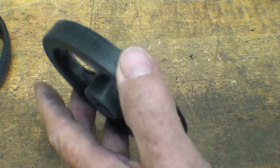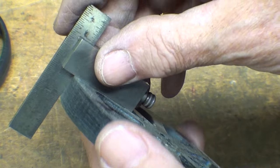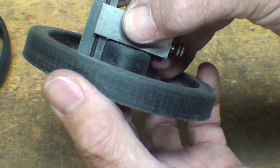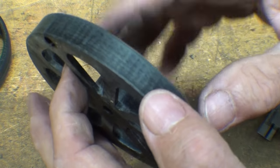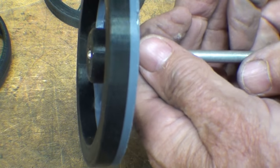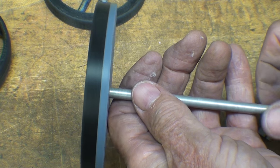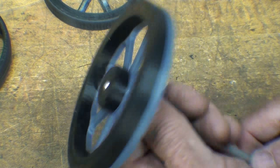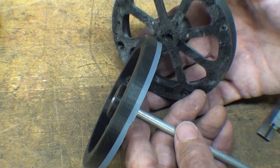Now that I'm spending more time with this 8-spoker, I'm finding there really is no pattern draft on it at all — same thing up near the rim. So it's going to be troublesome. I mounted it in the lathe and cleaned it up a little, but for some reason this one just wobbles, so I can't hold it in the lathe without another method. I'm not going to spend too much time on it, but I'll put the mounting pins on and struggle with it in the sand mold, though I may give up due to the lack of draft.